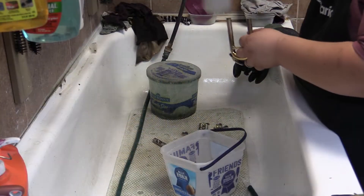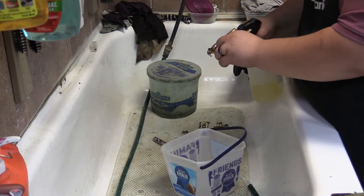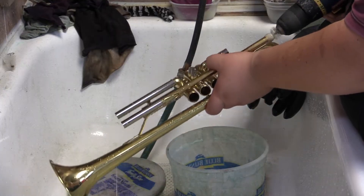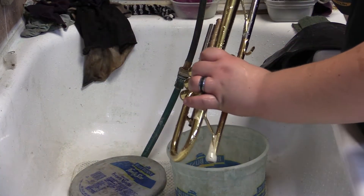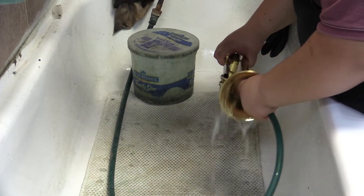Now that we've solved that problem, let's get back to cleaning. Next, we use cold cleaner and delimer to degrease and delime the inside. A light pumice soap slurry is then used with brushes to clean off the remaining cold cleaner and delimer. This is the bulk of the cleaning process, which is removing larger particles of dirt and debris before ultrasonically cleaning it.